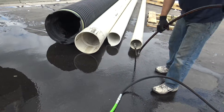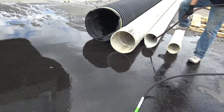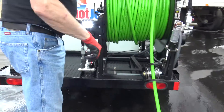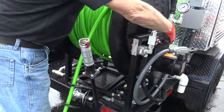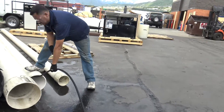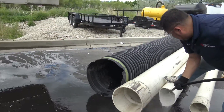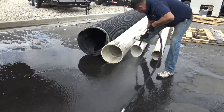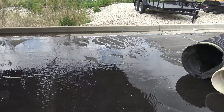We're going to go ahead and put this down the 10-inch line. We're now going into jet mode — hose reels are now live. Turn your throttle up a little bit and we're jetting. This hose is going to have about 20 pounds of pull on it, so it's going to work for you. When you're done jetting, shut your hose reel off, put your system into bypass, and throttle down.